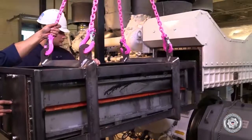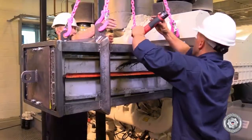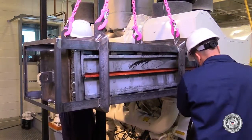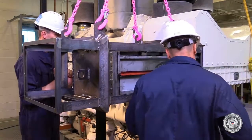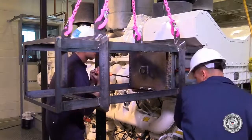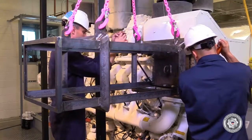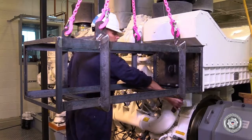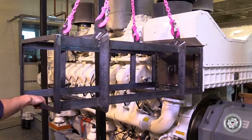Assure your Condition A cooler core has sealing strips on the side of it. If not, contact product line. With the Condition A intercooler core in the cage assembly, attach to the housing of the intercooler and, using pry bars, lifting gear, and chain falls, pull the intercooler core assembly into the intercooler housing. Once installed, remove the cage assembly.